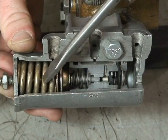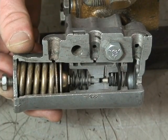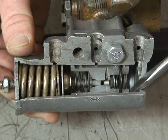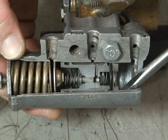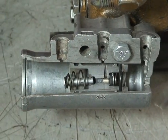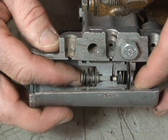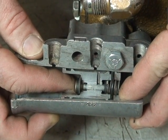When we adjust these, we often adjust them to 120 to 130 psi before they'll compress. So if we have it adjusted to 120, as soon as we get 120 psi on the bottom of this piston area, the piston will start to move. It will compress the spring, and as it compresses the spring, this little inlet exhaust valve here will be held in position. The piston will move over and that little inlet exhaust valve will crack open.